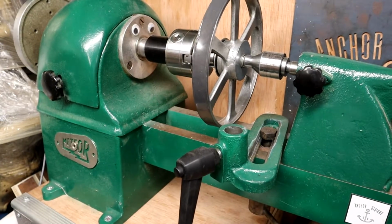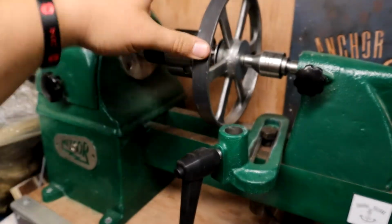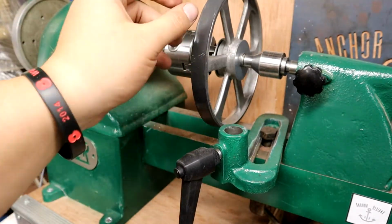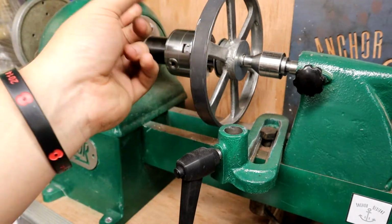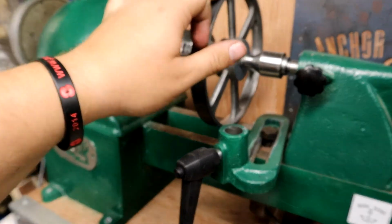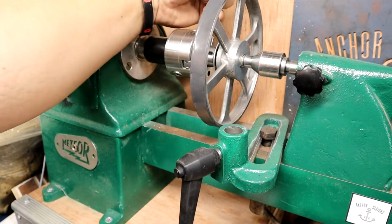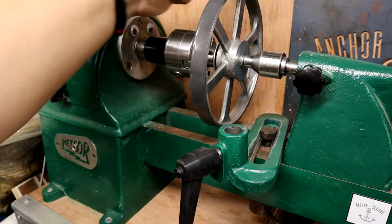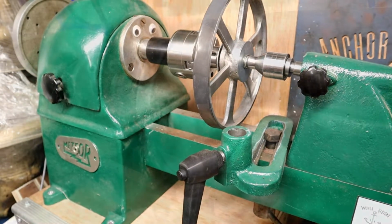Okay, very quick. I did say I'm not going to do this, but I thought I'd just show you my setup. So I've got the bushing in here onto a mandrel, and I'm just going to sand this just so it's flat. It's a different colour, and it sands up slightly lighter, so I know when I've got that flat. As well, I'm looking down the line from here to a line on the back of the board, so I can get a rough idea of when it's actually concentric.